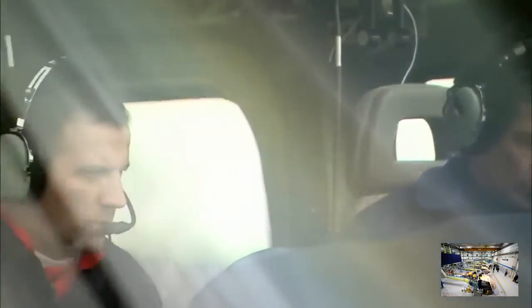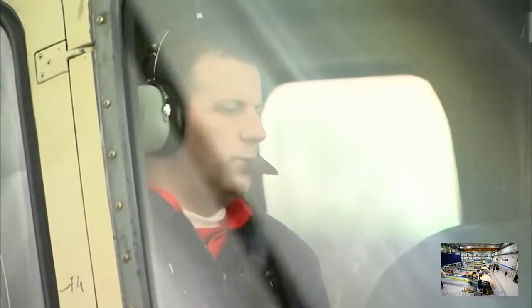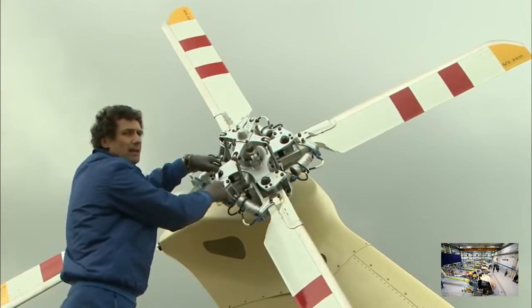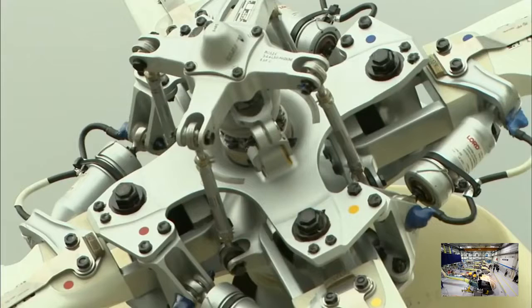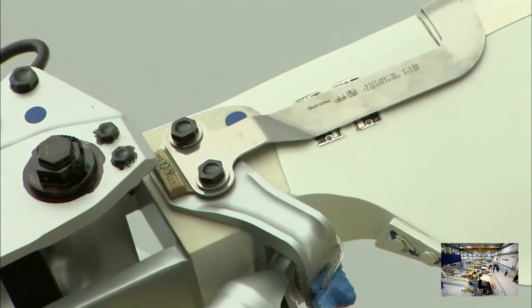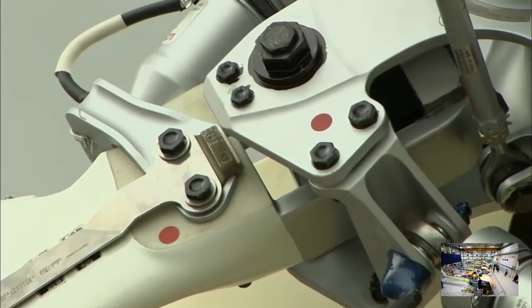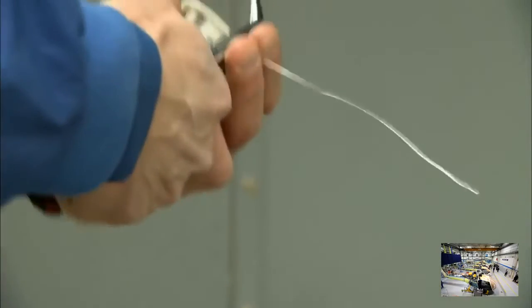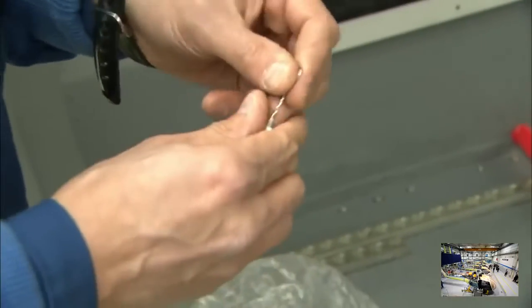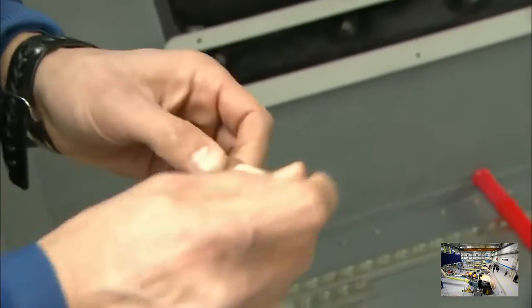And this one needs a surprisingly low-tech tweak. The vibrations are over the limit. The rotor's out of balance. The tail blades are color-coded, and Gianluca's instruments indicate it's the red one that needs attention. It's a procedure very similar to balancing the wheel of a car. A length of wire, 3 10-gram tungsten beads, and a plastic tube is all you need.